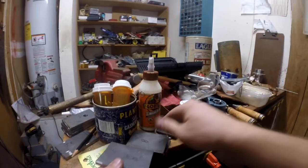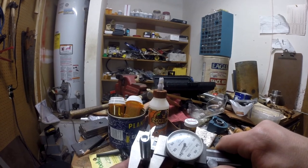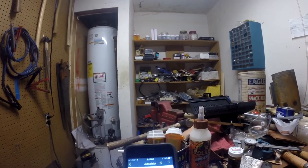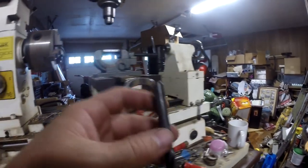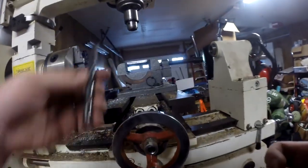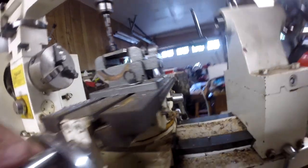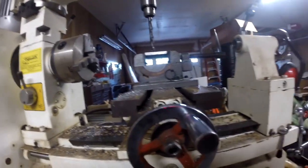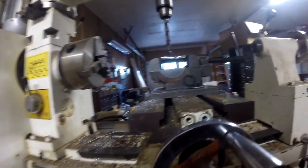We've got one of the plates and the template here. It's not perfect since I can't cut them exactly, but I'll mark the best center dot I can manage. I've got all four clamped. These bolt holes measure about 0.37 inches, so 3/8 inch at 0.375 is the size we need — and I've got a 3/8 bit right here.